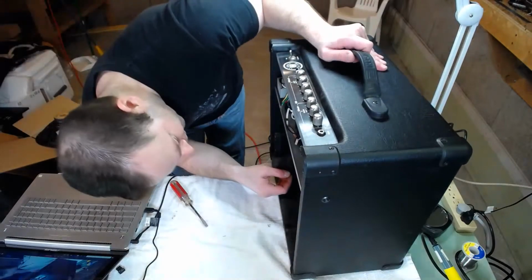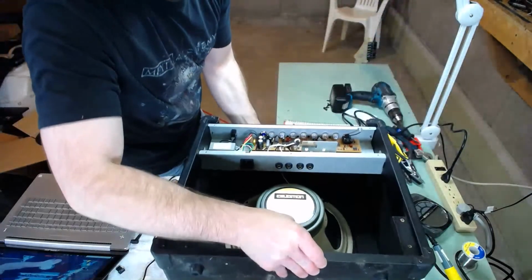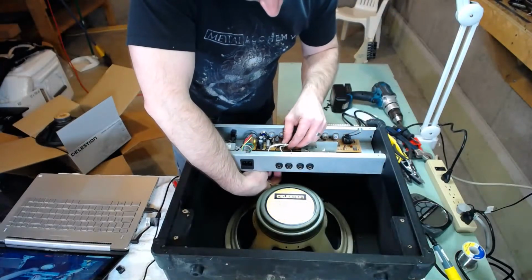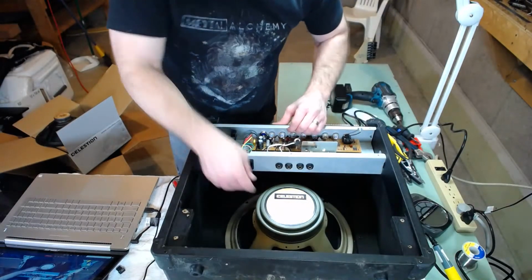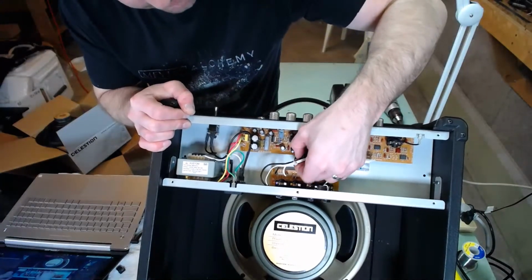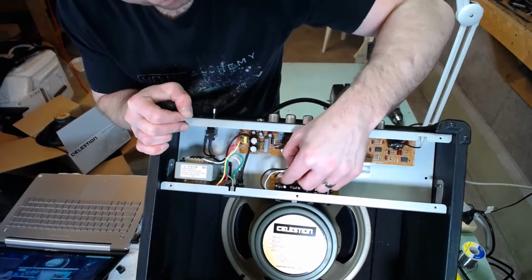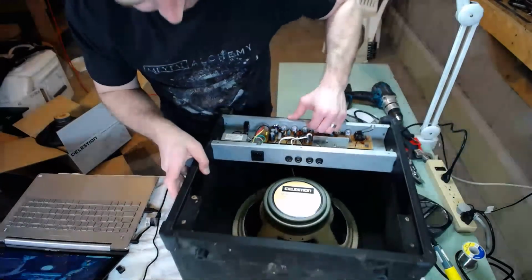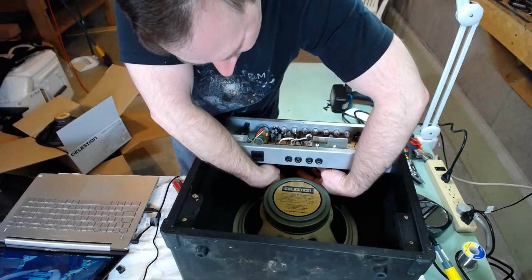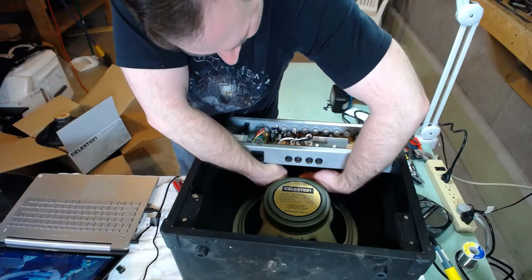All right. So get in there and connect it. Probably should have done that earlier, but so according to the board here, probably can't see that there, but so these are the speaker output, and we got white going to plus, black is minus. So I'm going to keep the phase the same. It doesn't really matter for a single speaker, but if you got a multiple speaker amp, then the phase is going to matter. Or multiple speaker cabinet.